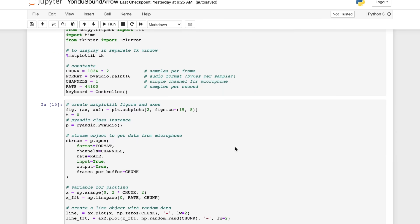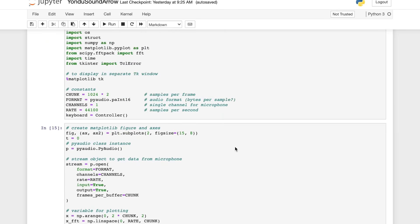To do this, I'm going to take the pitch of our whistle and use it to make the drone fly forward or backward. I think anything more than that — up, down, left, right — would just really overcomplicate things. So I started by writing a Python program that displays the frequencies of our whistles. And when I say I wrote a program, I mean I stole pieces from other people's code and put them all together — I'll link all my sources down below. I'm not a programmer, but I do know a little bit of physics: all whistles are made up of a bunch of different frequencies.